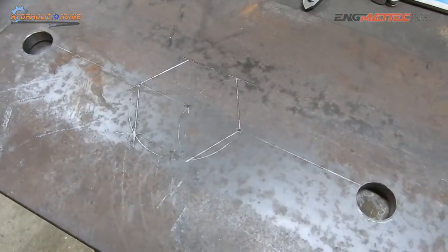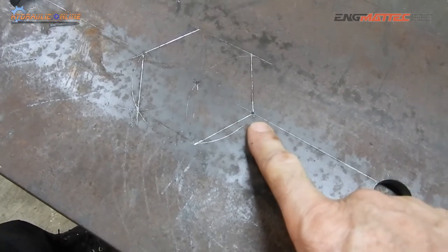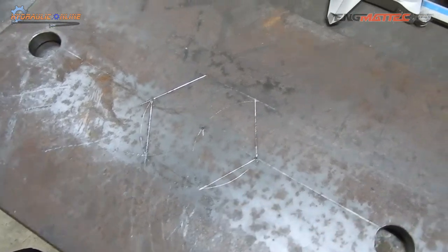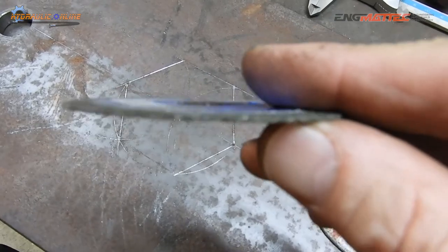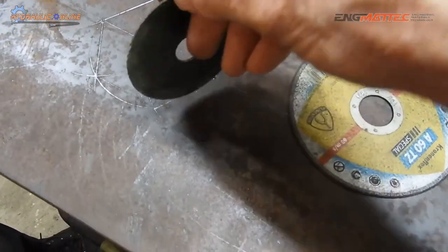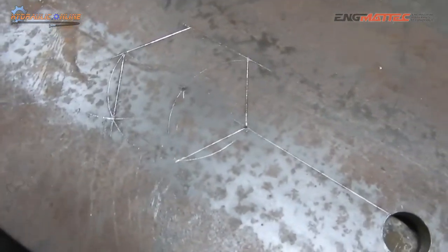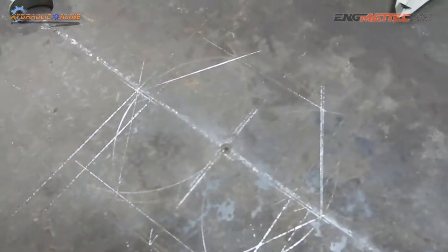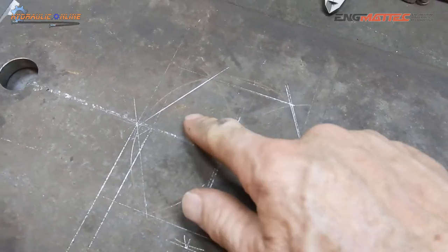Awesome. So we've got a double breakout plate here, with a 79 millimeter hex marked out here. We've got two options, but to maintain accuracy, we're actually going to do it the long way by using very thin cutting discs. It's not going to be super pretty, but it should be much more accurate than cutting with the oxyacetylene. I don't think we can get the accuracy we require with oxyacetylene. And just flip that over. That's our first successful one we did, and we actually got it really well, and that's what we need. We need a hex with a 100 millimeter across the flat.